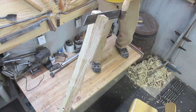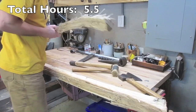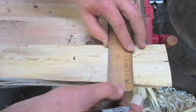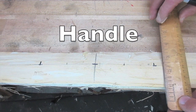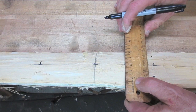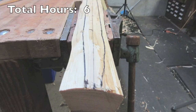Now I'm going to use my fro and my mallet to start getting the stave down to size. This stave is 70 inches long. I've got the center line marked with the string and a mark for the very center. At each end, I'm going to do a quarter inch on each side of the center line. At the six-inch mark, I'm going to go three quarters on each side. At the transition mark, four inches below the center line, I'm going to go three quarters on each side. At the bottom of the handle, two inches from the center line, I'm going to go half. Where the handle is going to go, I'm going to do kind of a bulb. I've got the bow traced out.